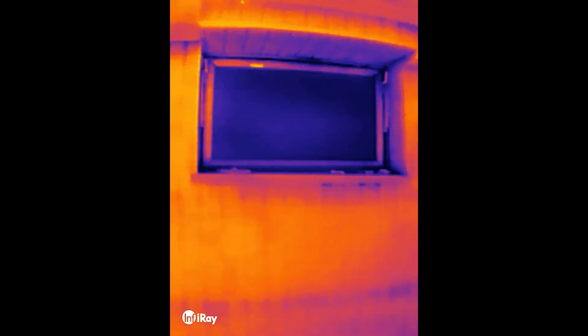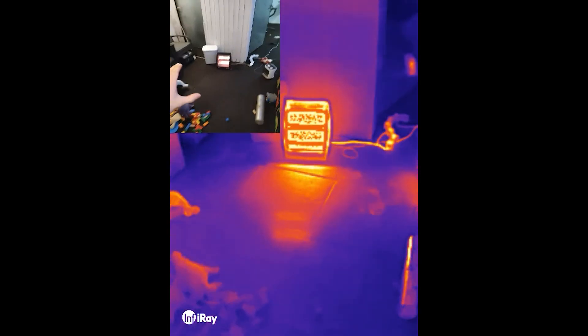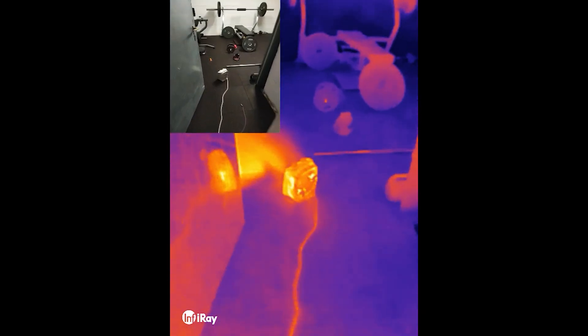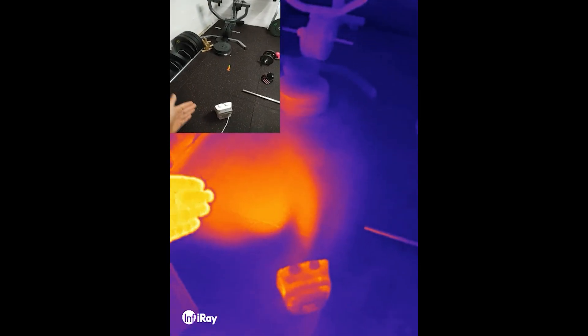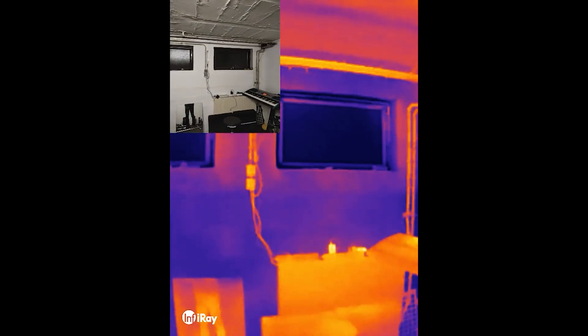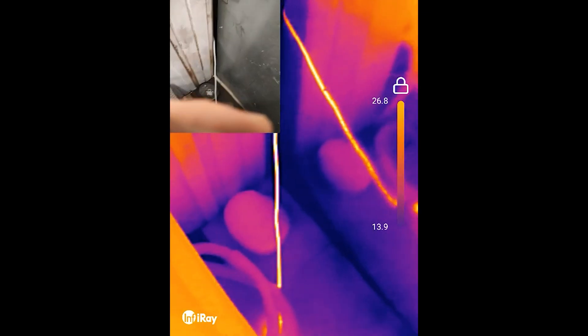Let's check out this basement. We are downstairs and can see the windows right here — pretty much no insulation whatsoever. In the background you can hear the heaters: one, two, three right here. Interestingly, you can clearly see the path where the hot air is blowing — you can literally see the airflow. These two windows also clearly show the airflow. We are maxing out 3,500 watts, so the cables, especially for the main multi-outlet, are getting fairly hot.